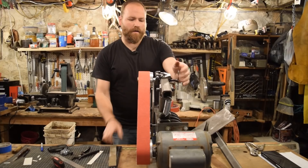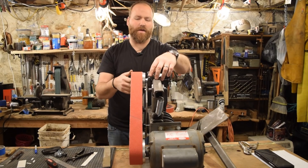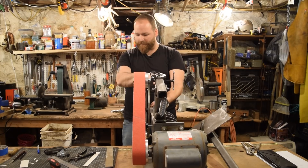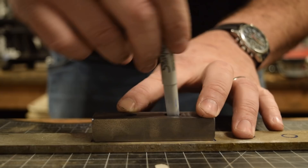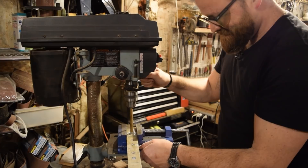I'm working on the tracking now. Brian made the tracking wheel adjustable so I can slide the entire piece out, but I also need to work on the flat platen to get it in line with the motor. I have some flat aluminum bar stock, so I'm going to cut this into pieces and stack them up until I can get everything exactly in line — running straight front to back in line with my drive wheel, tracking wheel, and flat platen.